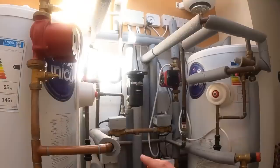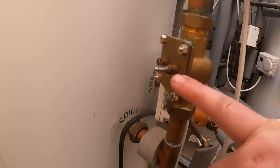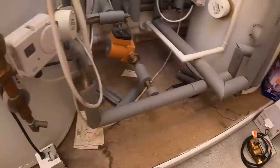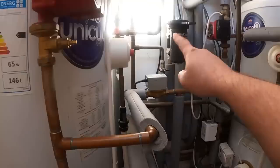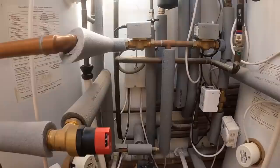Today's little job is in here - this little array of pipework. What we've got here is this two-port motorized valve leaking from the actual body. What it's done over time, it's got inside and it's been tripping the electric out. The electrician came out thinking it was the electric, but it's water getting in. So I picked another Honeywell one up. We'll get this swapped out, get this drained out, isolate the pump, isolate on that three-port valve, drain it down here and switch this over. Fairly straightforward.